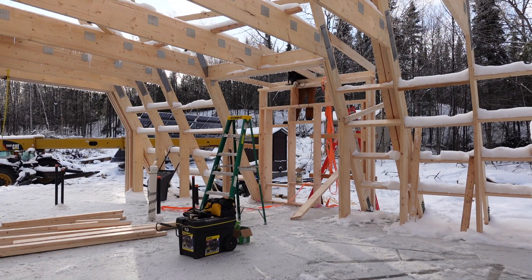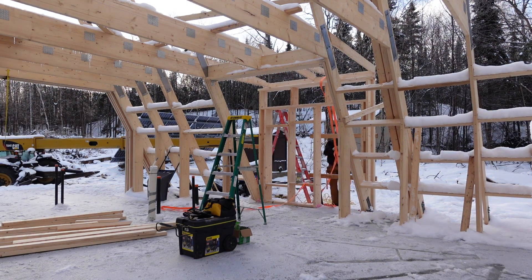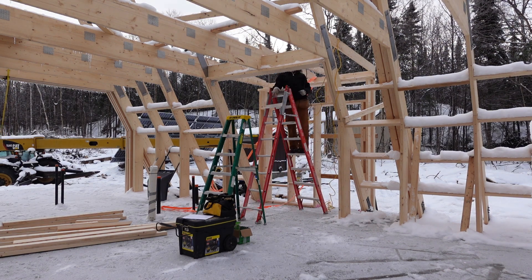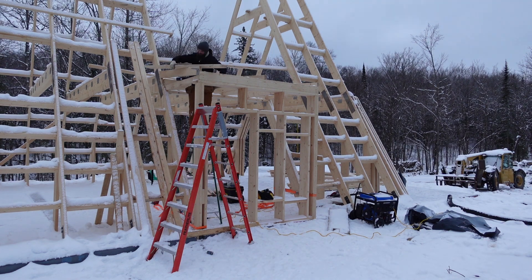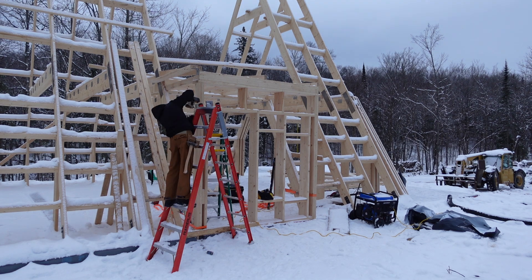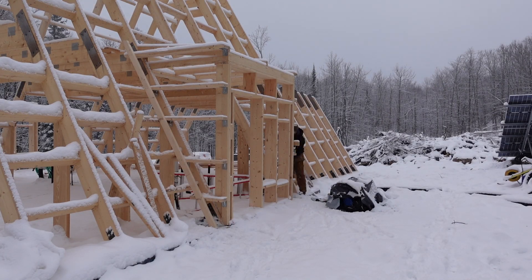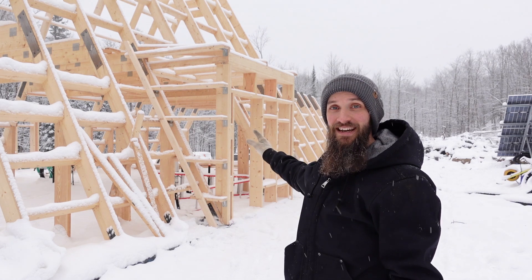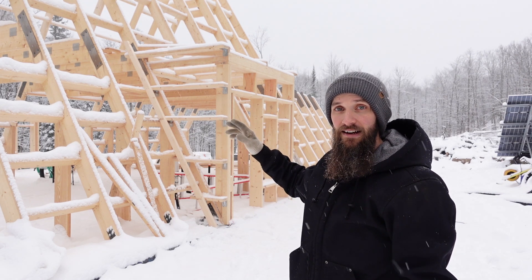I came back the next day and added the ceiling components and the roof components, and made sure the wall itself was perfectly plumb — meaning level in a straight up-and-down manner. Once it was plumb I added all the ceiling pieces and then the horizontal pieces onto the sides of the dormer, held on using metal brackets with 2x4s sitting on top of them. That is the first part of the house I could check off — the bedroom dormer is now ready for the house wrap.